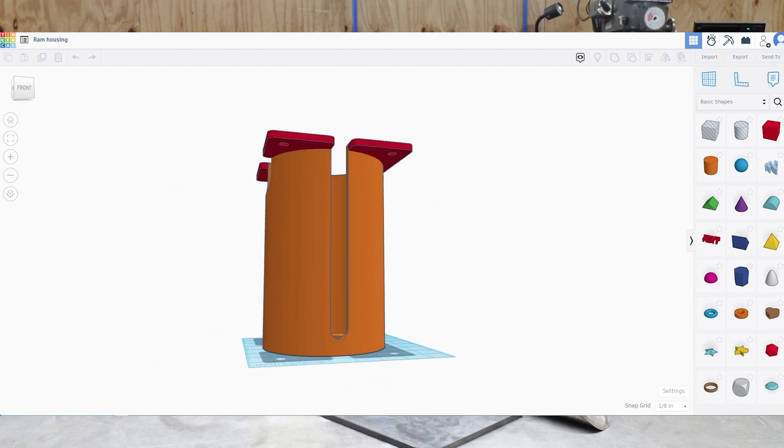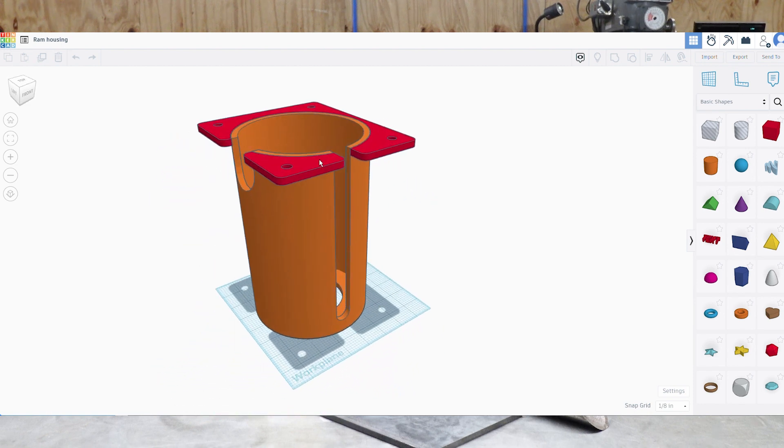Keep in mind we're doing two of everything here — I only drew up one because it's wash, rinse, repeat. We've got two cylinders and we have to cut these to length. We'll face both ends and use the lathe for that depending on the quality of the saw cut — we just need to be sure we're square when we weld this up. What has to be perpendicular is the mounting plate, the interior wall, and the bottom plate. We don't care as much about the top surface of the cylinder as long as we can come square and still have enough weldable material on the bottom side.